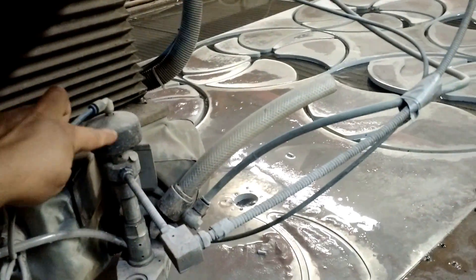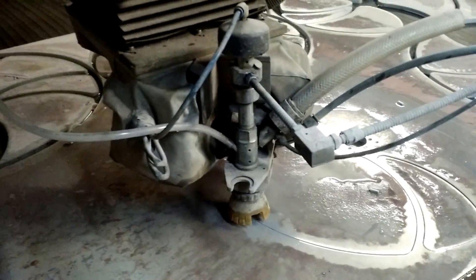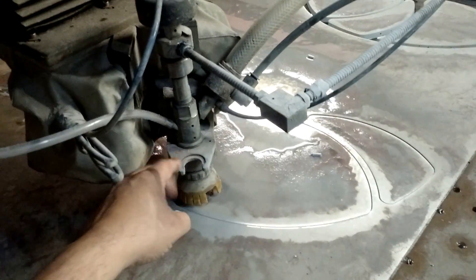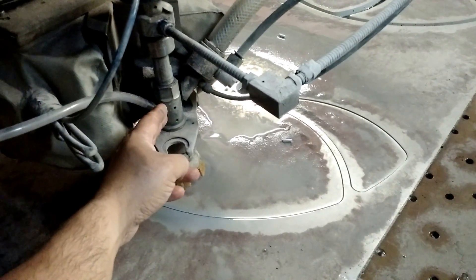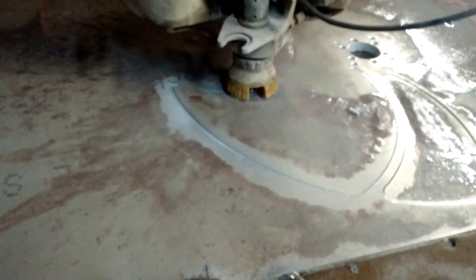This is a little air piston. You can see this is an air line and that opens and closes a tiny little needle and seat valve that's inside here, allowing the water to go through the nozzle. This line over here is garnet coming from the back of the machine. This is the infeed line. It's fed into this hopper and comes down through this little tube and is injected in the mixing chamber. That line does not have any pressure in it. The vacuum created by the water going through the nozzle is sucking the garnet in through the mixing chamber, and together the stream of water at 50,000 PSI is mixed with the garnet — that is how it's cutting this half inch aluminum.